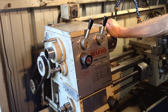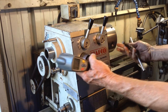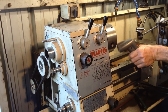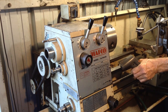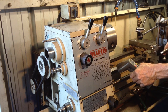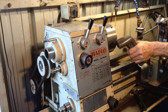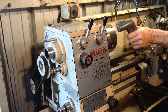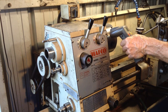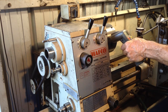Well, this has been running for a couple of hours now, so the average of the temperatures around the headstock casting varies. You get down the bottom here, which will be a bit cooler because it's next to the bed. We're about 37 degrees. Come halfway up, 43, 40, a solid 43 degrees C. Our labyrinth seal ring, which is closest to the bearings, running at 45.